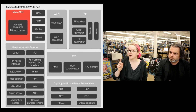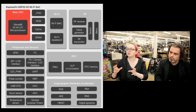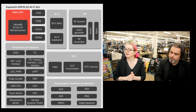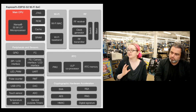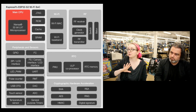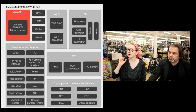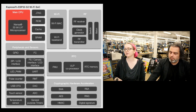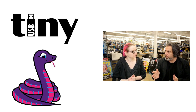Second, there is that built-in Wi-Fi. There's now a time-of-flight feature where, if you have two of these, you can tell the distance between them using time-of-flight — more details are coming out. It still has a ton of great peripherals: SPI, I2S, I2C, Touch, DAC, ADC. So it's very ESP32-like. One thing that did get removed is it doesn't have Bluetooth or Bluetooth Low Energy. The ESP32-S2, at least to start, does not come with Bluetooth — it's just Wi-Fi. And there's the Xtensa LX7 microcontroller with a couple hundred K of RAM, and I think there's also a RISC-V coprocessor in there. More details are going to come out soon.